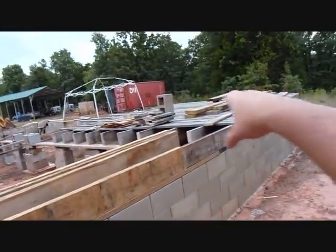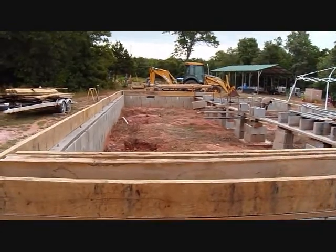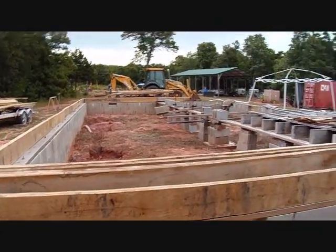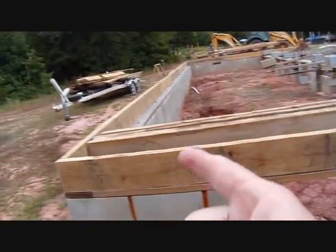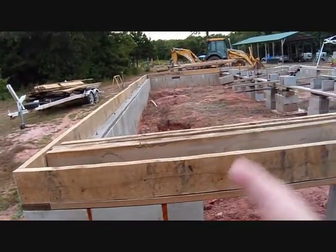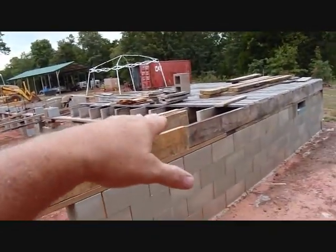Once I get all these floor joists on, all the floor boards for the subfloor, it's a rectangle. Perfect rectangle. So that's the point and the main thing. The structural under here is solid. I mean, these are 2 inches by 8 inches boards. Some are a little bit different. I'll probably have to shim under some, probably cut off a little bit, because that sawmill, when I was cutting them, it varies a little bit. But that's why they call it rough boards.